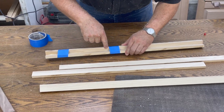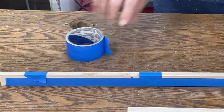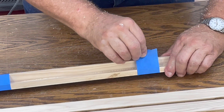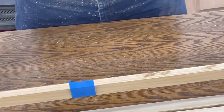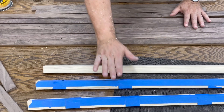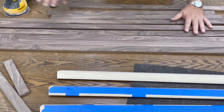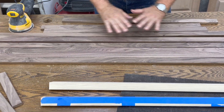You can see how that pushes the glue out and makes a little squeeze-out all along the inside miter. Our outside corner is held together by the piece of tape on the outside, and now we have our outside corner all glued together with our blue tape clamps. While our outside corners are drying, we're going to go back to our walnut strips and give them a nice sanding with 80 grit to get them cleaned up.